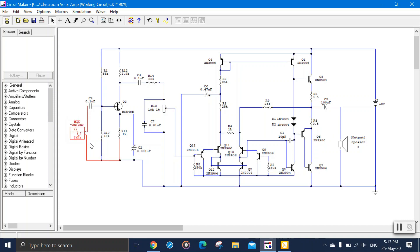We had to use a signal generator instead of a microphone as there was no component available for use in Circuit Maker 2000. This version of the circuit is the microphone preamplifier. This circuit is the internal circuitry of the LM380 chip. The output of the preamp is fed through a 10K potentiometer which acts as the volume control of the system. Its output is then connected to pin 6, which is the inverting input of the LM380 chip.